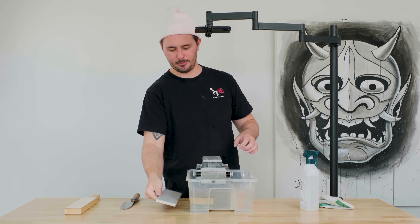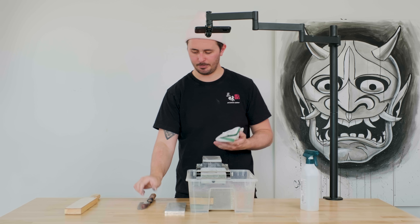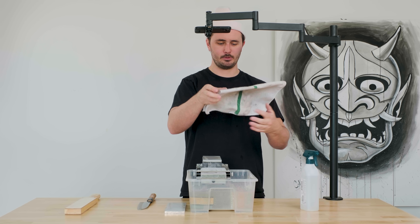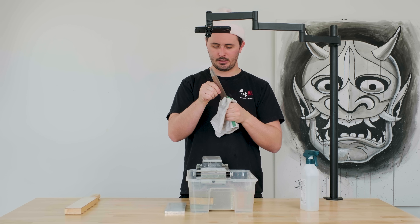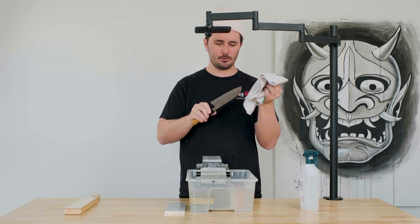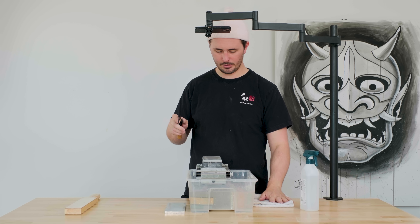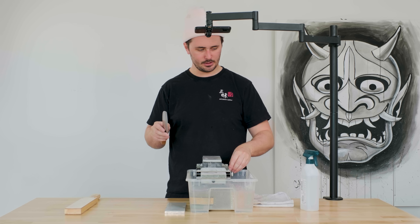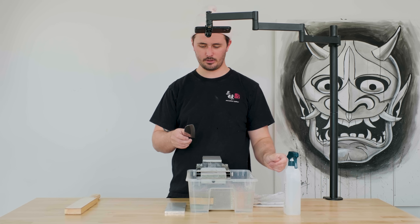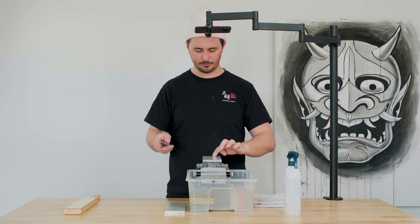Having a flattening tool is super important. A lot of people are always surprised to see how much we flatten the stones, especially on your low grit stones, which generally wear pretty quickly. Having a wonky stone is not going to make things easy for you — it's always easier to maintain a flat stone than it is to flatten a wonky stone. So just take a little bit of time every once in a while to flatten things out. Especially when doing our deburring, it's very important to have a flat stone.